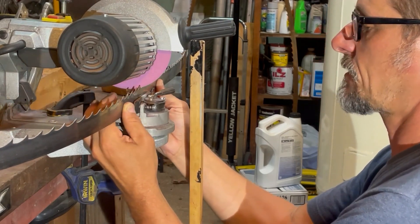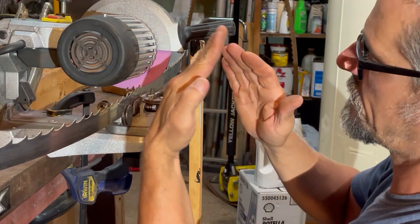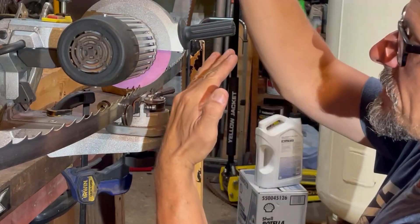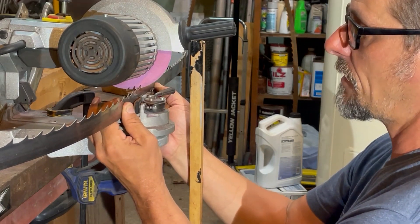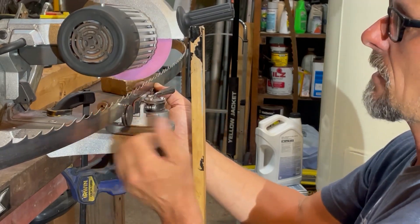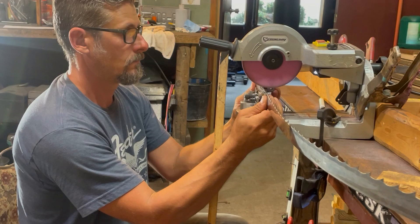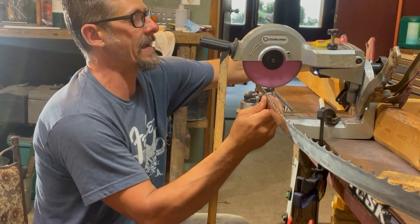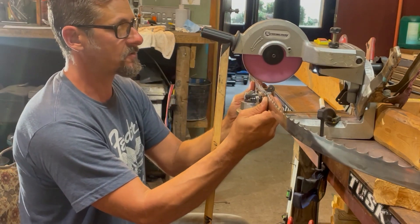As you're doing this, realize that the tooth is set back, so if you bump it and go straight up you're going to shave the front of that tooth off — which I've done plenty. You bear down a little bit and then back off enough to get past that tooth — about a 64th of an inch — so when you come up you're not raking the top of the tip off. Every so often you have to pull the slack out once it starts getting hard; it preloads and actually helps feed the blade.